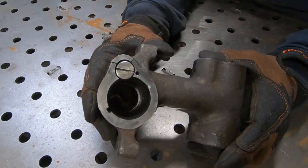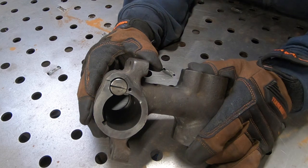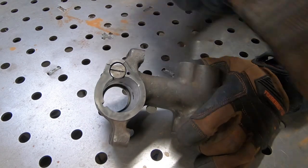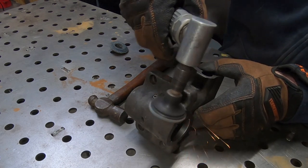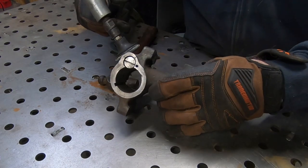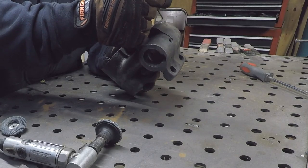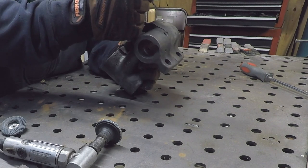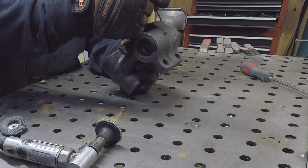As I showed during the disassembly, there's one long crack in the feed nut bracket where the longitudinal feed nut retaining screw sits. This is not a critical place for a crack and it really doesn't affect the strength of the bracket at all, but I still wanted to fix it. I started with a flap disc to clean away any dirt or oil residue, then used a carbide burr in a Dremel tool to gouge out the area of the crack.